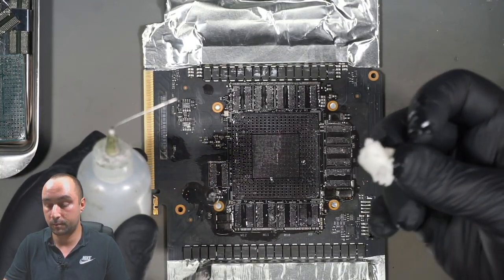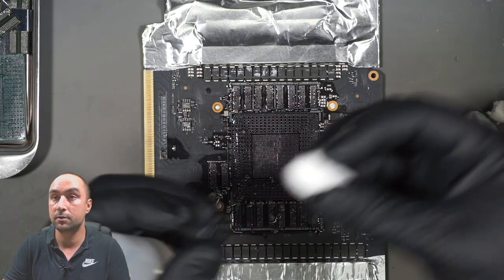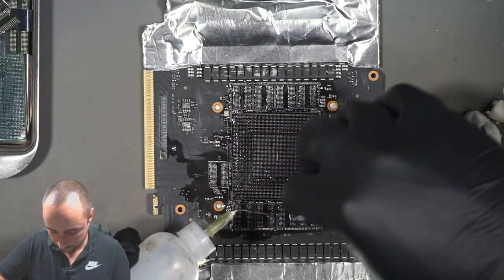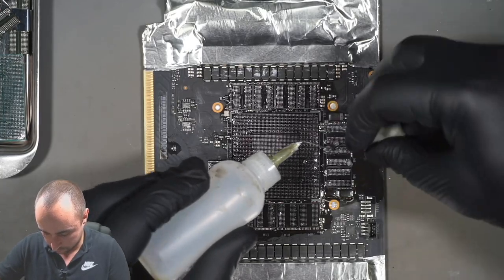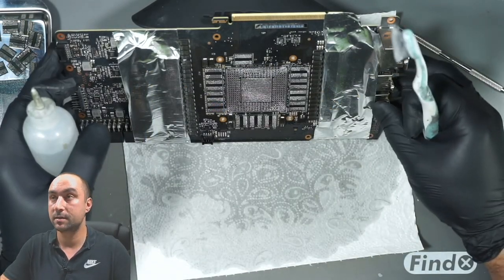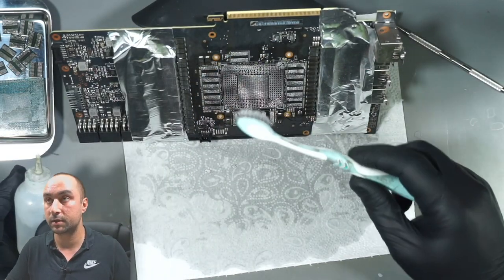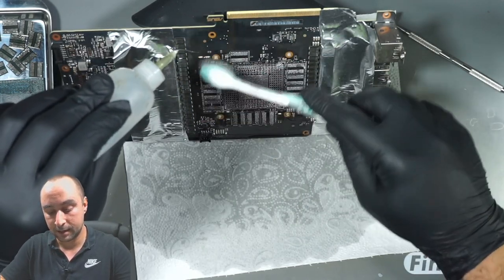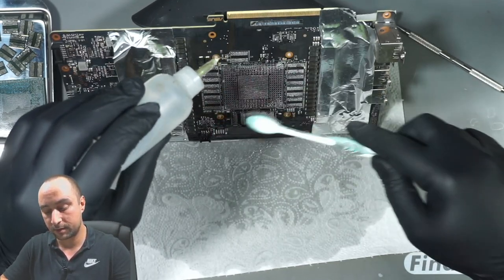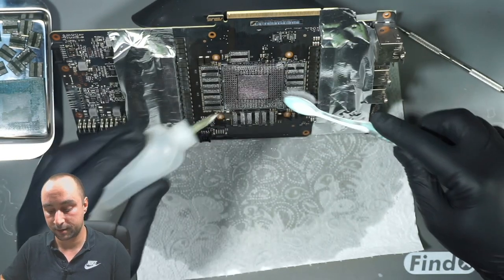I want to say that a lot of the liquid metal is staying here on the sponge, so I can change the sponge and continue. So here the next step is to place the board. I like to place the board at an angle like this, and I want to start from the top with the brush and alcohol, and clean the whole area. The main purpose of this cleaning is to remove the particles which are from the sponge, and after that we can use the soldering iron on a clean surface there.